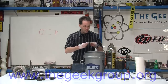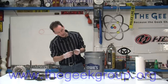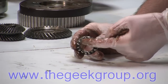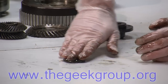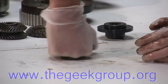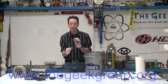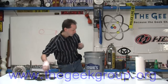We have a race out of a ball bearing. This bearing was a thrust bearing. You can tell because the balls don't actually come all the way out to the outside — the balls are mounted internally. This bearing is designed to work kind of like a lazy susan carousel where it sits flat and spins between two heavy things. That's called a thrust bearing. You'll find these a lot in power drills — it's the bearing you use because in a power drill you have to lean on it, so it's designed to take the push-in load.